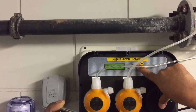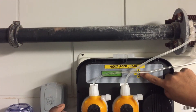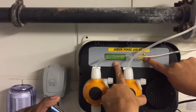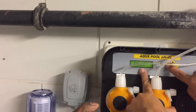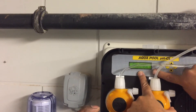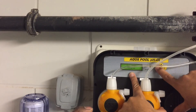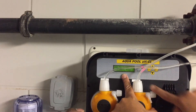One more thing — because we didn't set the flow sensor, we're going to go back inside again. Press 2 arrow up, 2 arrow down, enter, then press the F button. Look for alarms. Navigate past pH, chlorine set point, restore settings, alarms — press enter through each. You will see flow control; it's deactivated. Press arrow up to activate it, then press enter. Then you will come back out again. Press and hold enter to exit.